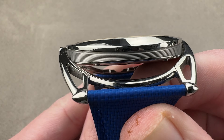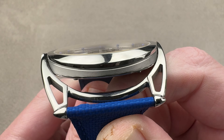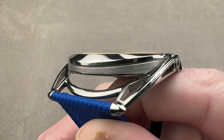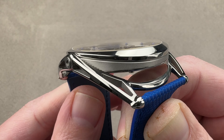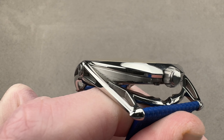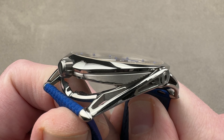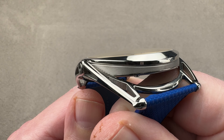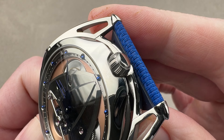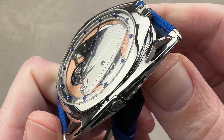This is a wonderful rising and falling profile of engraving done on an engine — just like a rose lathe, just like guilloche — this is micro light. It's a more modern-looking engine turning that watchmaker Denis Flageolet selected for De Betune, as something like a Breguet guilloche, a rosette, or a crosshatch might look wrong on this watch. This forward-looking, avant-garde engraving gives you the same quality and traditional craft, just with a more modern aesthetic. We also have a crown at the top with double knurling, polishing, and matte finishing, screwed down to protect it from inadvertent contact with the floating lug.